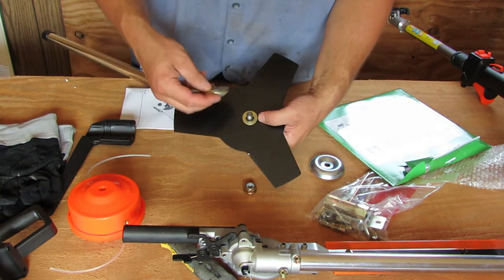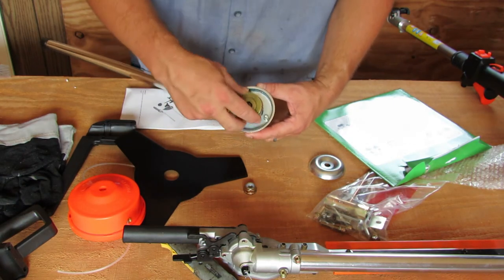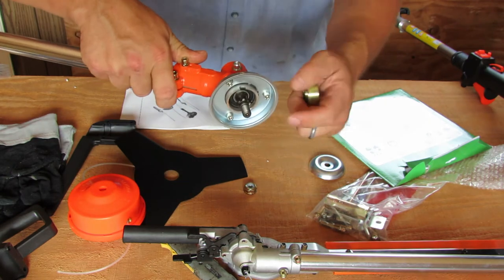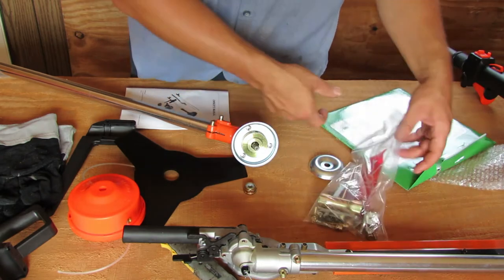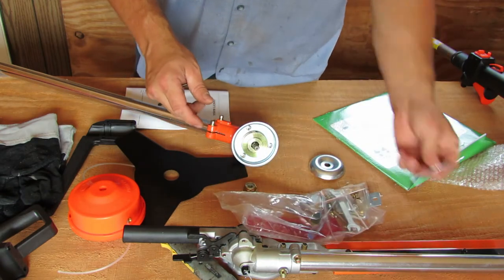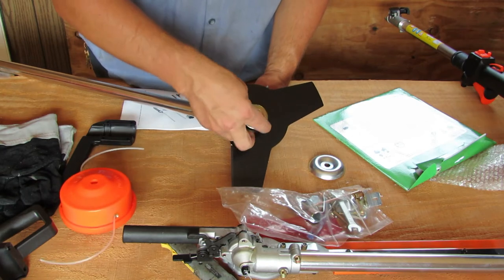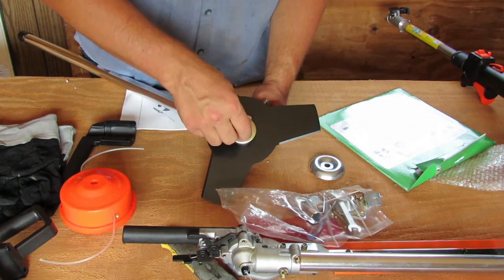The adapter is just like my Robin or any other brush cutter — the spline goes on there like that. It's keyed: it has a hole in the side, the washer has a hole in the side, and inside is a little groove, so you line all that up to lock it in place. I'd suggest a screwdriver or an allen wrench. It doesn't have to be spectacular — I use an old S-hook on a chain on my Robin.